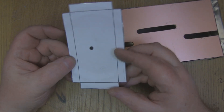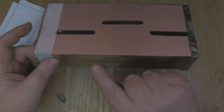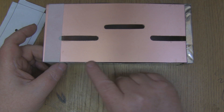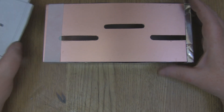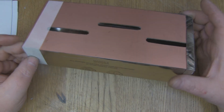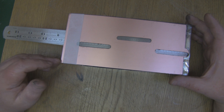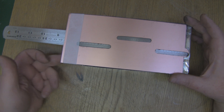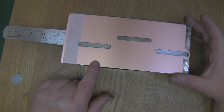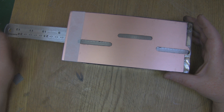I'm going to bend the edges on the end piece, make sure it fits nicely, and then start cleaning all the edges of the tin so everything is ready to solder together. I'm hoping I can flow solder along all the seams without using any glue, and solder the top on. I'll leave the bottom until last because I still have to do the mounting for the feed itself. As far as the template goes for a first prototype it's come together quite well. I've put some packaging and cardboard underneath to prop it up, and used three metal rulers to take up the few millimetres gap I needed — just using whatever I have to hand to help me.